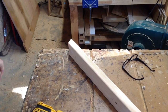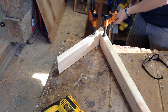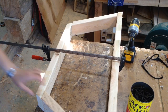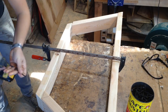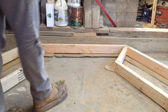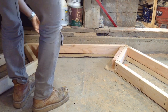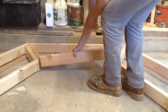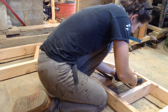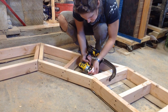For the angles, I had to use clamps in order to screw everything together. The angled sections are just going to be harder than the square sections, but with those clamps I could screw everything together and then clamp and screw together the front, similarly to the square boxes. I do add middle braces on all of these — I don't think I show it in the video, just kind of as backup. I would build the two sides first, and then the middle section I always built last, because that could make up the difference of anywhere I'm off on either side. Once I had all of my bottom frame, I clamped everything together and connected them with some 2.5-inch screws.